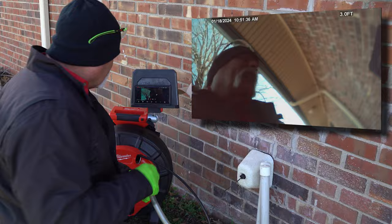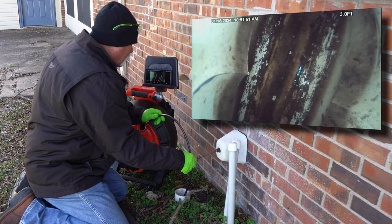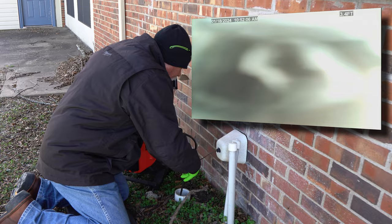We have Colton and Squirt back here giving me a hand today. We're going to drop the sewer camera down in there and you can get a really good look. I don't like these - I call this a double clean out, a two-way clean out. I like the ones that are two combinations crossing each other, but with one like this you just have to make sure you turn the cable and get the camera going in the direction you want.